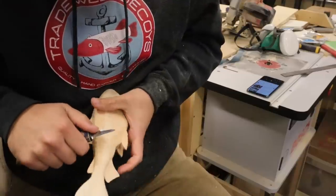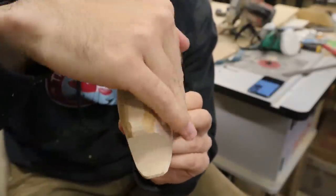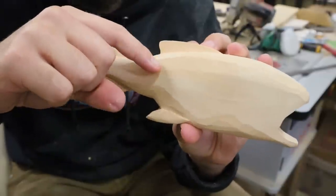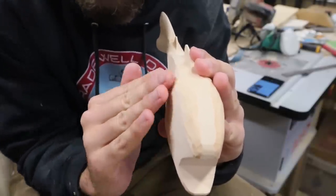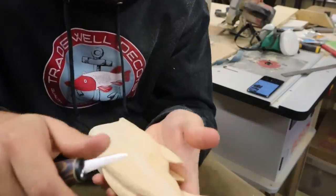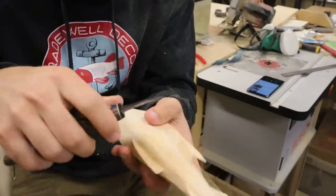This thing requires a lot of carving. Right now I'm doing something pretty specific. You don't want just 90-degree chamfers — flat on the top, flat on the side, just round on the corners. You want shape to all of this. You want to be carving all the way down to the middle of the body so the shape goes out, turns in, turns even more on the top, does the same thing on the other side. As a rule of thumb when trying to make something look natural, you do carve a ton of wood off just the sides which would have otherwise just been flat.